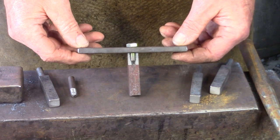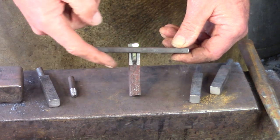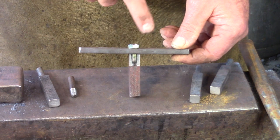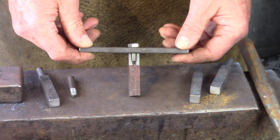For larger projects where you've made the frame first and then want to put the internal workings inside, it's very nice to be able to just drill and tap, offer up the internal workings, and then put in your tenons and head them over. So frame first and then put in the internal workings — a useful thing.